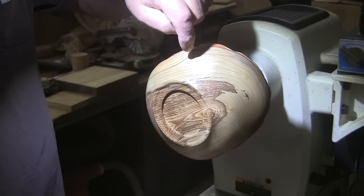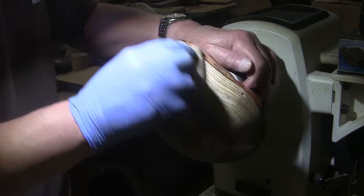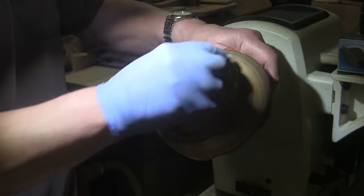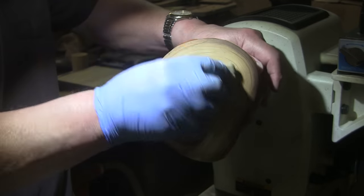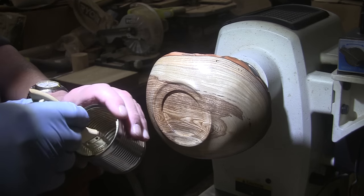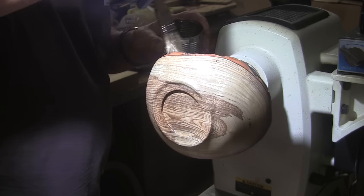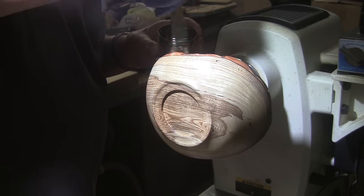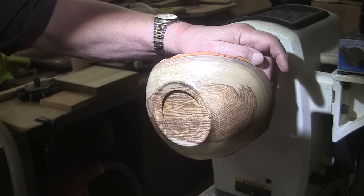This is shellac-based sanding sealer, and then I'll apply shellac over this. I usually do two coats of each. I expected to do two or three coats of sealer on this piece, but maybe two is going to do it easily. And of course I have to brush the bark, so I've got some sanding sealer in this little can. This makes quite a little bit of difference. I'll bring it back in a little bit and we will start working on the inside.